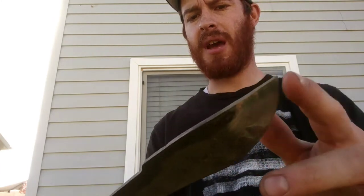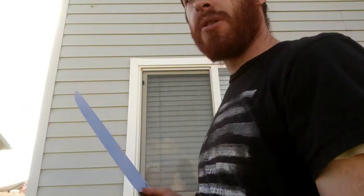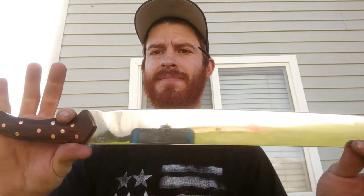But so this is the first one, the kukri, about 9 inches. It's a fun one to use. And then the other one I'm going to be using is this big boy, 17 inch blade, 5-inch handle, same leaf spring as that other one, and same heat treat. It's a little bit narrower. I've got this one ground down to about 3/16. That kukri is at about a quarter. But these other ones I'm going to be using just to have some fun.